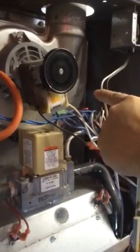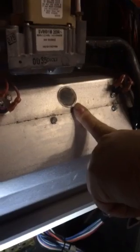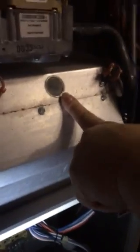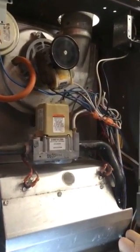Okay? So when that happens, and it checks out with the control board down here, back up here, it'll start igniting. Once it ignites, inside there's a flame sensor. That sensor senses the flame. That's going to tell you that it's okay. There's gas being burnt. It's not just raw gas being spewed inside here, okay? So that's what's happening here. So we're going to change this motor out, and this should take us maybe 5 minutes, we're hoping. Okay, so hang on with us.